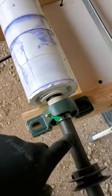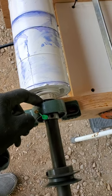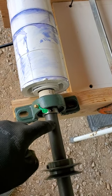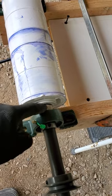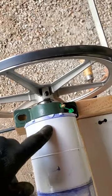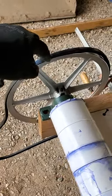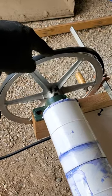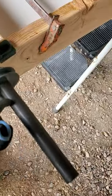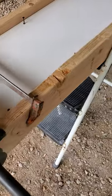This shaft is inch, and the inside of one-inch pipe is also inch. I'm planning on screwing a piece of this inch pipe — tapping this pipe and screwing them together — then gluing and sliding this barrel onto it so it's glued to that, which is screwed to that. The other end I'll probably just drill through, tap the shaft, and put a big countersunk head and crank on it, and hopefully it stays. These wheels are easily available on Amazon — these are swamp cooler wheels. I bought a 12-inch and a 14-inch to get the proper reduction. I did not calculate a thing; there's gonna be a big wheel onto a little wheel on the same shaft to this big wheel, and that ought to be enough reduction.